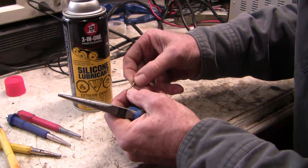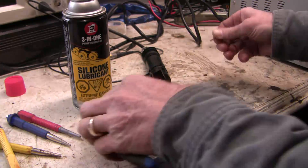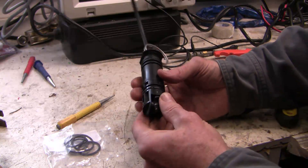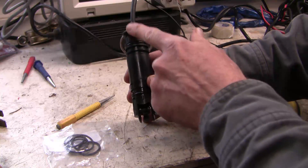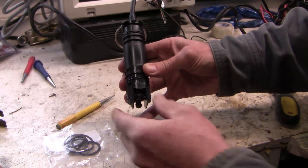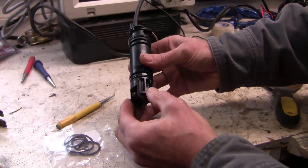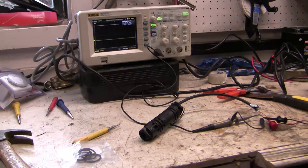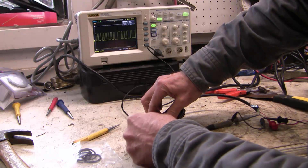I can see quite a bit of rust on this now, and perhaps some of that rust was what my issue was. I've got the new one in place — anybody who's done any manufacturing will know that if you can put it in backwards you will, so be careful: this is the front of the boat. These little things are like shovels for the water, so make sure the shovels are pointing forward so the water will grab the paddle wheel. I'm a bit surprised it's nothing more than a press fit, but it seems to be holding nicely — presumably it's below the hull level and the hull prevents it from sliding out. I've already got my electronics set up, so I double-checked it and sure enough the new paddle wheel works just as well as the old.